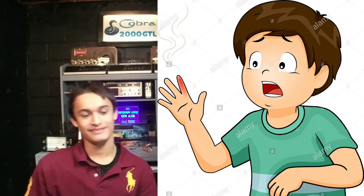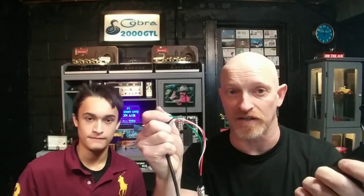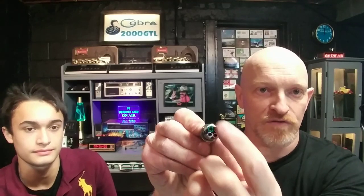What's the problem with soldering and unsoldering? You burn your fingers all the time. But once you've got it hooked up and it works — you've got receive and transmit on that radio — you look at the color-coded shield covering here. I did the same colors where the position would be for each wire, so you know when you unplug it which one goes where. You just solder that same configuration to an end for this microphone, and voila. You've got every microphone in your parts bin working.